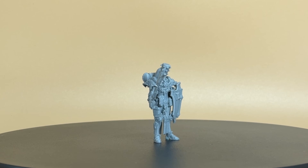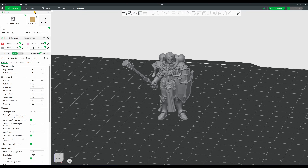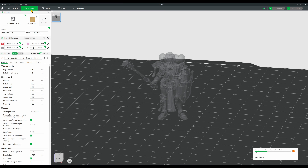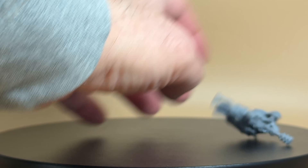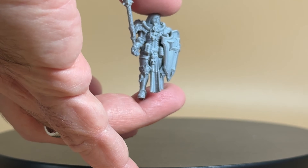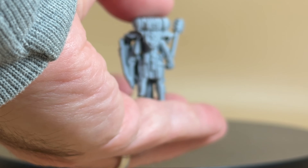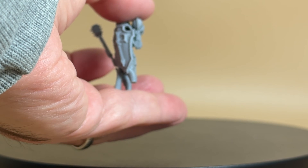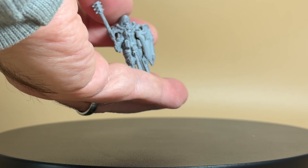Now it's a matter of dialing in the settings. Let's do another baseline with the proper quality settings reset. This time around, I reset everything, including the speed changes to make sure that I wasn't setting things faster than the profile calls for. So the only things that remain changed are the support settings because, well, we need those. We're still looking at around 2 hours print time. This model is about 40mm high, which is well below what our Ogre was. As you can see, I had issues with the foot again, and I mistakenly removed the supports over a trash can full of all the support material and I lost the foot. Other than the foot problem, the only real issues with the model are some of the artifacts that remain after removing supports, and that's an issue throughout all these prints. Quality-wise, it looks good. I feel like now we're getting to the point where we're optimizing for minutiae, but that's still something we should strive for — to squeeze every last ounce of quality we can. There are still a few more tests to do.